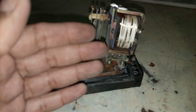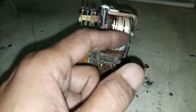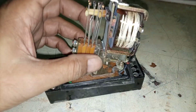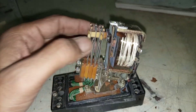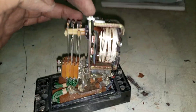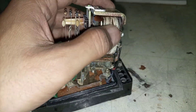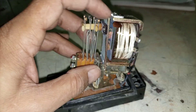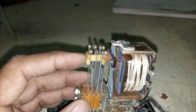The electromagnetic coil has the function of producing an electromagnet. When we provide 220–230 volts to this coil, the coil is magnetized and it attracts this armature — this piece of mild steel metal — towards the coil. There is also a spring; in this particular model the spring is located underneath. So when power is provided to the coil, it magnetizes and attracts the armature towards it, and then the contact set changes state.